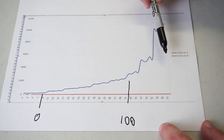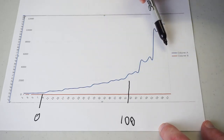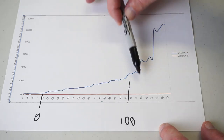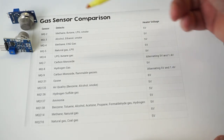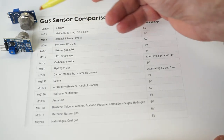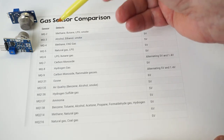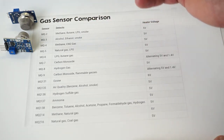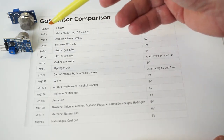This area here, HScope would overscale. It would be unreliable at any rate, and the sensor itself would, at prolonged use and this high of a concentration, get damaged anyways. So that's why in practicality I was able to go with a linear calibration on these modules. Why I think it would have been a fool's errand trying to match them to a specific part per million, and that using those bookends 0% and 100% is more intuitive.